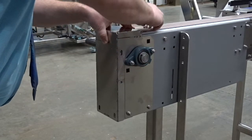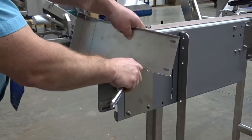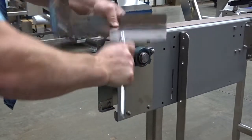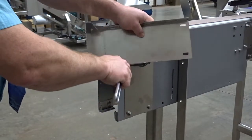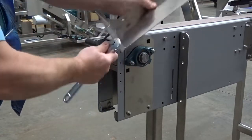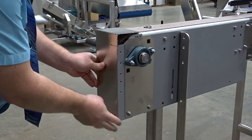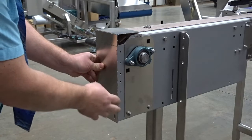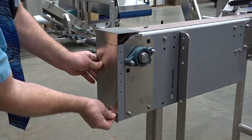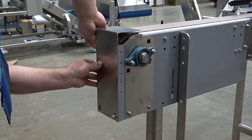Unbolt it from your conveyor. Either a crescent wrench again or a duckbill vise grip — just break these tabs off, the ones that you want. Then when you remount it, clean these edges up after you break those off, as there are little sharp spots on it. There's a bolt hole down here, and bolt it on the other side just like you had it before.